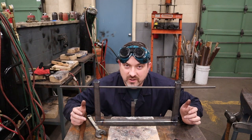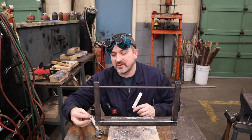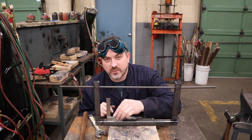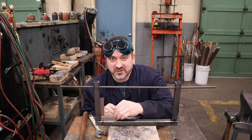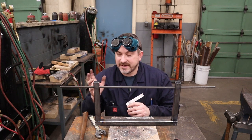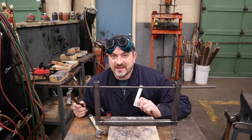Now that we have these tack welded on the ends, we took the magnets off. It's time to check if these are exactly where we want them. One of the first things I always check for is square — as the tack weld shrinks, it's going to pull the piece over, so I fully expect a little bit of a gap at the top when I put the square in. Put the square flat, slide it to the edge, and look for a light gap. In this case it's actually pretty good. However, if there was a big gap, get your hammer and hammer it in the direction needed so you can see no light between the square.